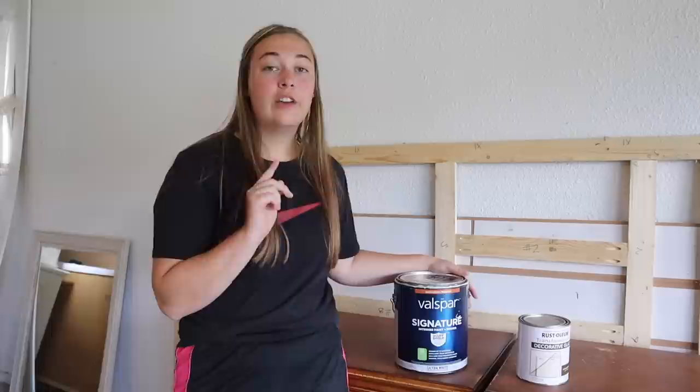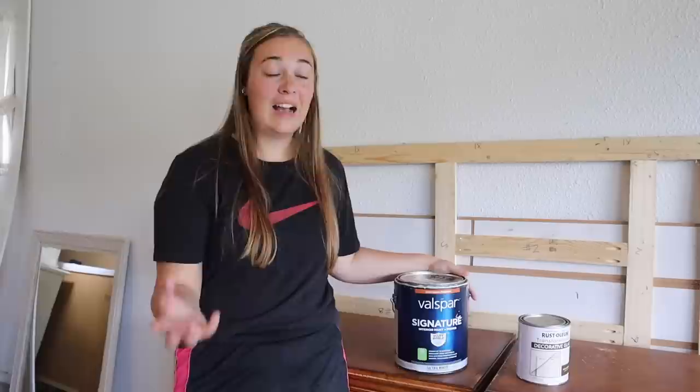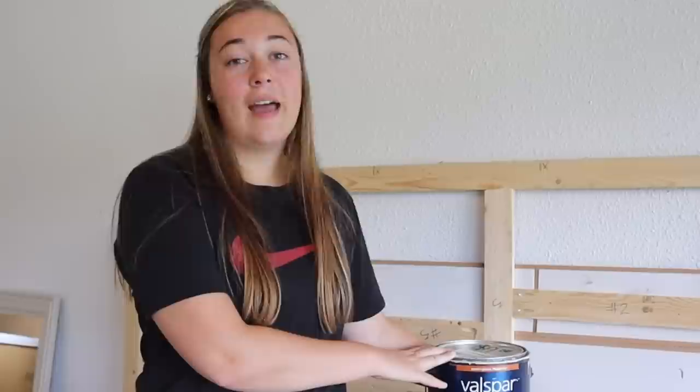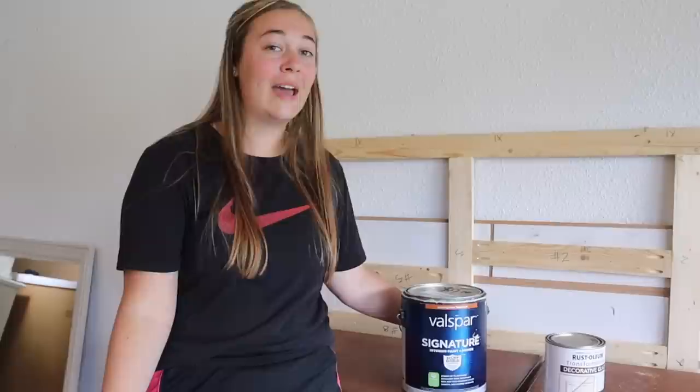If you did watch my latest video on me using this specific paint, I actually didn't use any primer and that piece held up really well. I stand by the fact that I don't think this paint actually needs primer, but I am going to prime these specific nightstands, and let me tell you why. Unlike the dresser that I did in the last video, these nightstands have some places where the finish is kind of breaking down, and when that happens on wood pieces, you can run into bleed through.